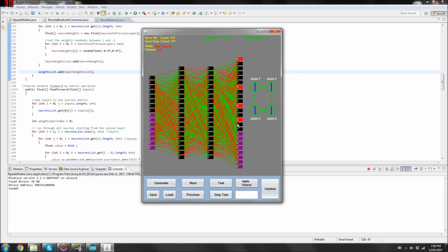Now you can actually convert this output, the black and red parts, you can actually think of each four as one. So one, two, three, four, think of it as joint one. The next four, joint two. The next four, joint three. The next four, joint four. Okay? Basically, the first four, the joint one is competing with which one is going to affect it. So the first one is 15, so the joint is going to move 15 degrees forward. The next one is going to move 5 degrees forward. The next one it's going to move 15 degrees backwards, and the next one it's going to move 5 degrees backwards. Okay, so whichever one of these is the highest, that's the one this joint picks. So in this case, this joint would have moved 15 degrees forward. Okay, the same with the next four and the next four and the next four.